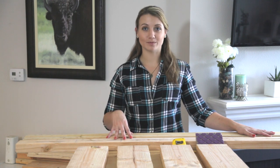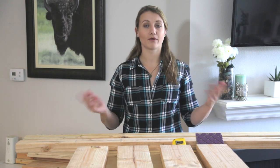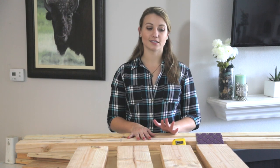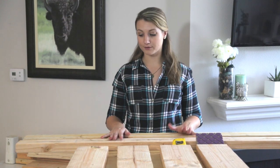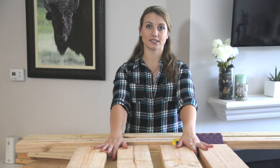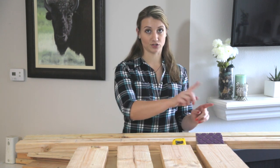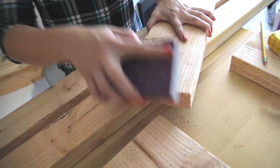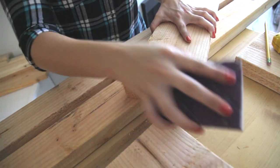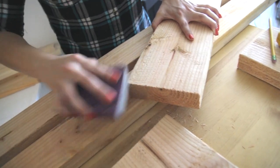You're going to need to go to Home Depot, Lowe's, or your hardware store — wherever you can buy wood — and get a 2x4 and a 2x6. You're going to have to ask the nice people at Home Depot to cut it for you. Have them cut your 2x4 into a 60-inch length and your 2x6 into four 17-inch sections. Chances are after they cut it, you're going to have some rough edges. Just take a sanding block, coarse grit, and sand it down.